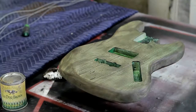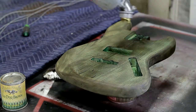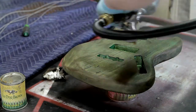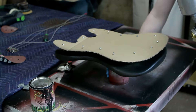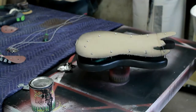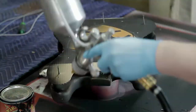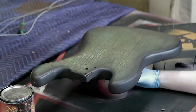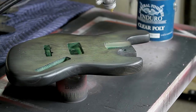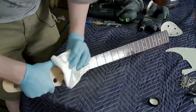After that I sprayed on two more light coats of the trans-tint green. I picked up this trick online: trace the guitar body on cardboard, cut it out, use screws to offset it, then spray the sides at about a 45-degree angle with General Finishes Lamp Black milk paint — gave a really nice effect. For the top coat, I sprayed on General Finishes Enduro Clear poly, which is awesome stuff I used constantly in my cabinet shop.